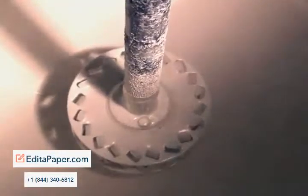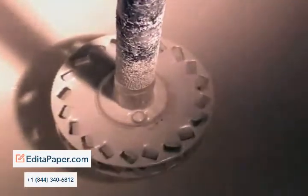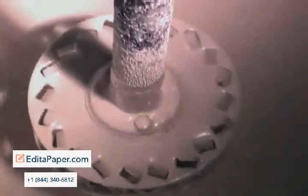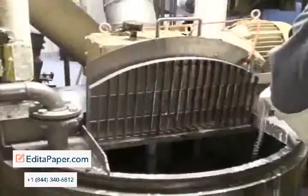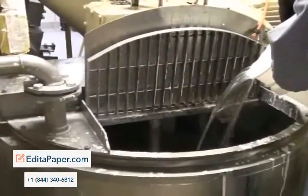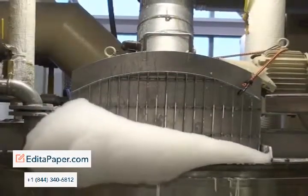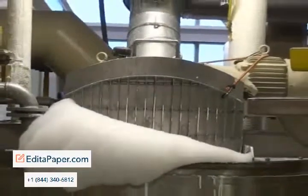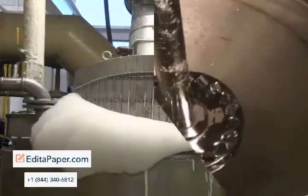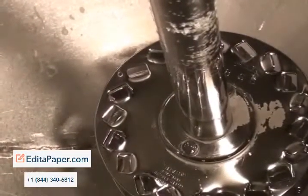The second tank also requires extensive cleaning. This tank has been used to mix a number of binders. These materials had hardened on the tank interior. Ultrox L is added to the tank along with a small amount of caustic. The product is then recirculated from the tank through the lines and pumps and back at a temperature of 160 degrees Fahrenheit. The tank containing the latex and other binders is also effectively cleaned.